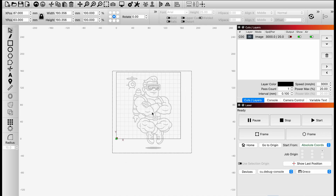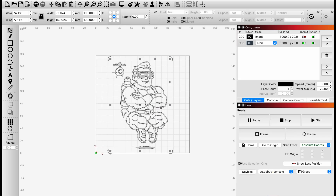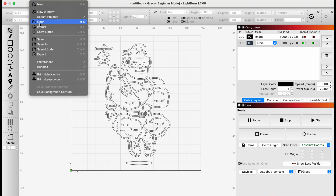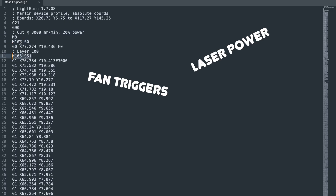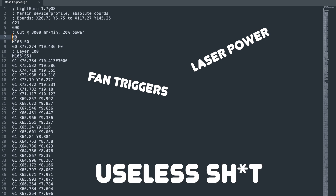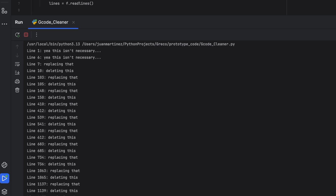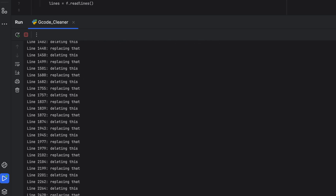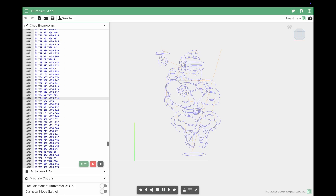If you want to draw lines, things get a little bit more complicated. I started by downloading Lightburn, which is a popular laser cutting software. This machine is not a laser cutter, but it's close enough — all I needed was a tool that could vectorize images and export machine-readable G-code. After setting up a custom profile for the drawing area, I could import images, trace them into vectors, and save the exported G-code files. The problem is that G-code is filled with useless commands — fan triggers, laser power, stuff that obviously isn't needed. It also doesn't include any Z movement since lasers don't lift. To fix this, I feed the G-code through a custom script that cleans it up by removing unnecessary lines, identifying breakpoints and line strokes, and then adds in the appropriate pen lifting code. It's hacky, but it works.